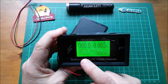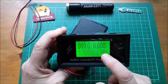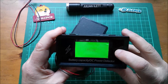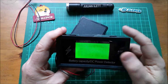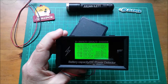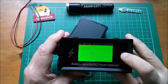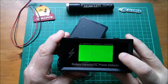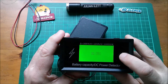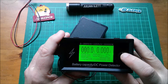Back to the unit: you've got the Chinese screen and the English screen with large numbers. This gives you watts, amp-hours, kilowatt-hours, cost, and temperature. The other gives kilowatt-hours, CO2 equivalent, cost, temperature. Then there are settings for how long the backlight stays on. This is a one-button interface and it's hugely confusing. Double-click then press-and-hold to change, triple-click to go downwards. I'll set it to 35 seconds - a single click moves you to the next screen.